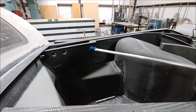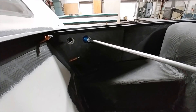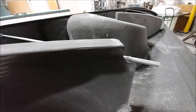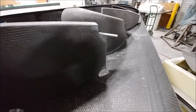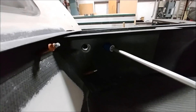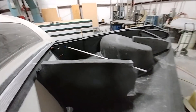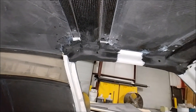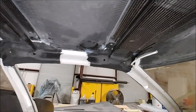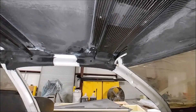Back on the fuel tanks, Jeff has the fixture that's going to plumb into the back wall of the tank. He's attached a bit of aluminum tube to it — that's where the warm fuel is going to come back from the heat exchanger to keep the fuel in the tanks warm, and also to keep the engine a little bit cooler. And lastly, Jeff got the peel ply removed from where he did the layups on the hinge bosses, so those look nice and smooth now — once painted it'll look neat and tidy.